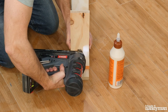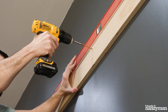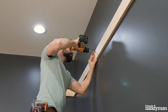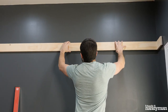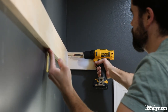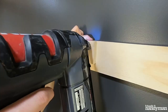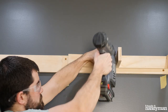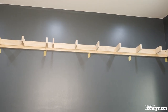I'm starting by adding a support arm to the end of the cleat. This will support the top of the shelves at the ends. Then I'm attaching the cleat to the wall with screws. Since the wall is more than eight feet, I have to add a second length to span the wall. Then to add the support arms to hold the shelf up, I'm starting in the middle with a spacer and adding arms to either side of that using glue and nails. I'm adding spacers and arms out from the center until I reach both of the ends.